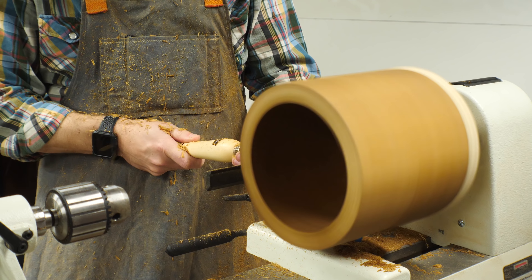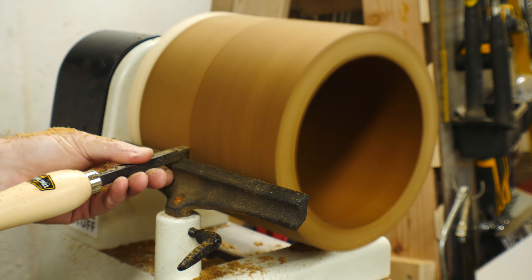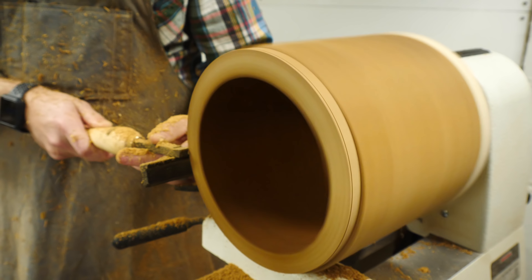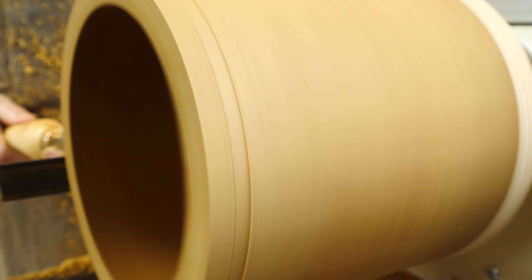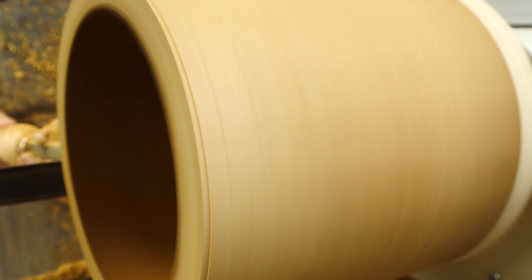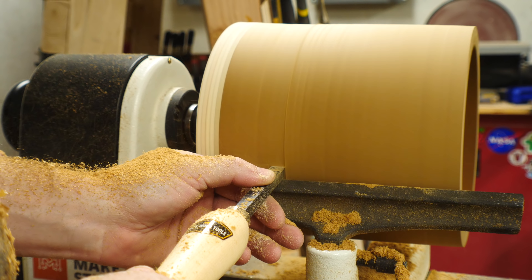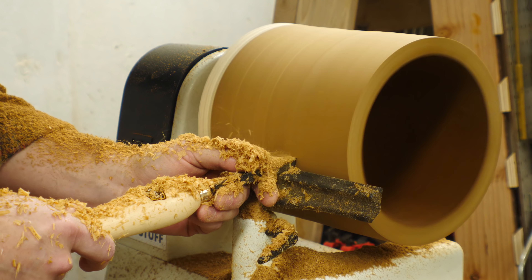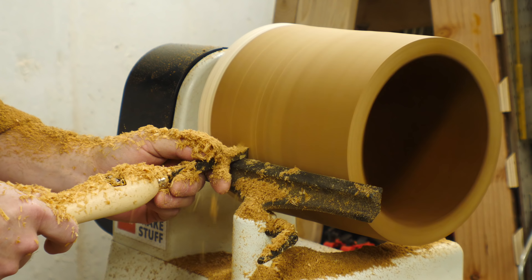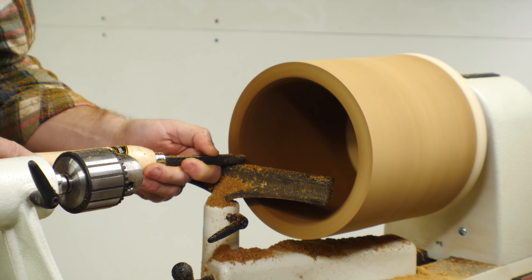After that I made sure to take my time and not try to cut off too much in any pass. I was probably a little more cautious than I really needed to be, but this one turned out just fine. Basically I'd never turned anything segmented, never turned anything this big, and it was offset a little bit from the center point, so there were a lot of things I was just trying to figure out as I was doing it. Last time I tried to taper something I got a lot of really great suggestions from you guys in the comments, and I used some of those when tapering this. The taper is very slight, but your suggestions really helped — thanks for that. After I got the outside turned to a cylinder I added the taper and then started working on the inside bottom.